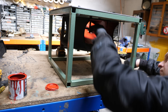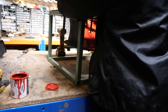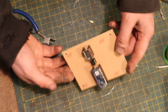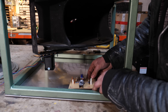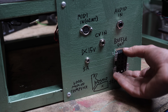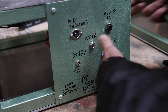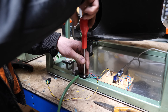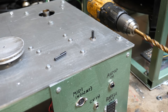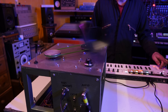We could put it into its housing and start giving it a nice little coat of paint. I did it red on the actual baffle to show where the sound comes out. People were suggesting using lights but you can't beat a nice bit of red hammer finish - it makes it look like a classic museum display piece. Anyway, we're gonna use an Arduino. This is the same circuit as in the previous video - if you're curious how it works then check out that last video. The code is also available via a link below on my website. This is the original horn that we built in the last video. I've got a multi-point connector there called a Cinch Jones connector, and we're gonna use that to connect all of the connection pieces over to the baffle via this multi-core cable. Let's first get a few fine-tuning knobs in there, because people wanted a base level so it would always spin instead of stop - so you can fine-tune the slowest setting.